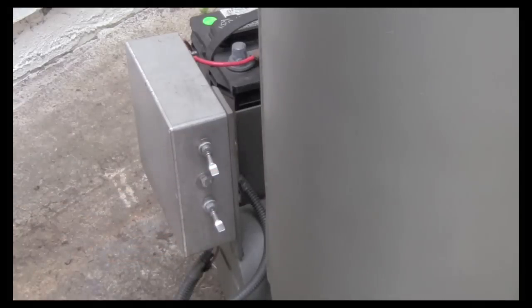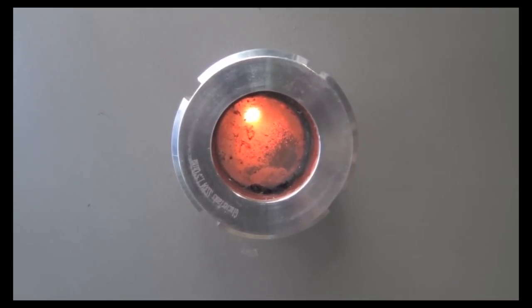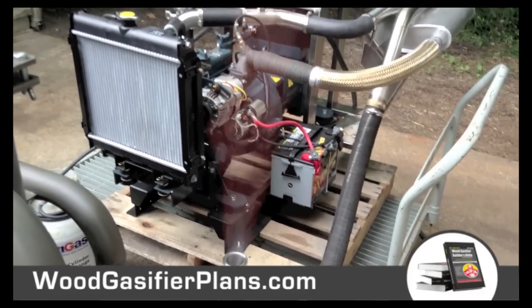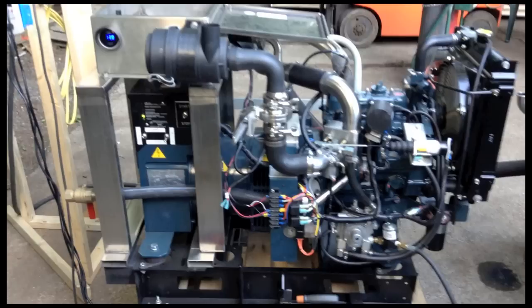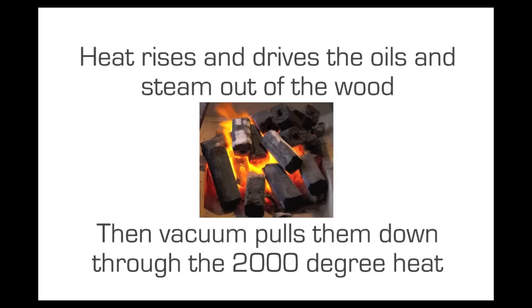What's really remarkable about the way this process works is that deep inside the machine there's all this charcoal being formed, and there's air jets blasting into it. And it creates a singularity, this hot point of energy, that's 2,000 to 3,000 degrees Fahrenheit. And so it's really changing the molecular chemistry of things at that temperature as the gas passes through. It's a very clean distilled gas.